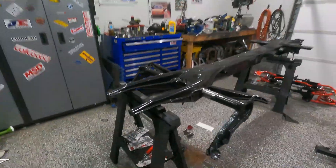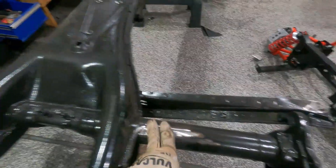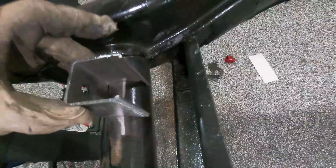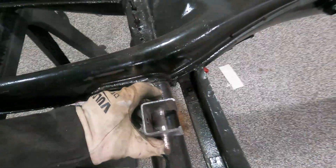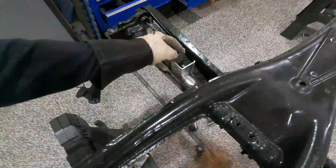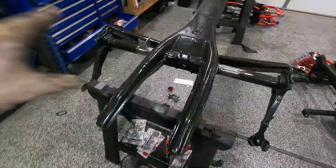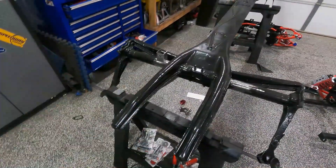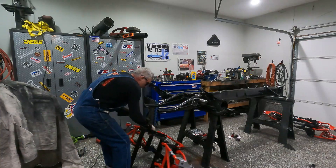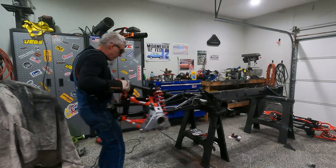Let me show you what I've got done. This is the back side — I flipped it over, so this is the bottom. I got this cleaned up here. The way these brackets are going to go, they're going to weld kind of like that, so I've got to clean up some more paint back there. I don't exactly know where these are going to go yet. I'll finish cleaning that up — one's going to go on each side — and then flip it back over, put the rear end back on, position those, tack them in, flip it back over, and then weld it.